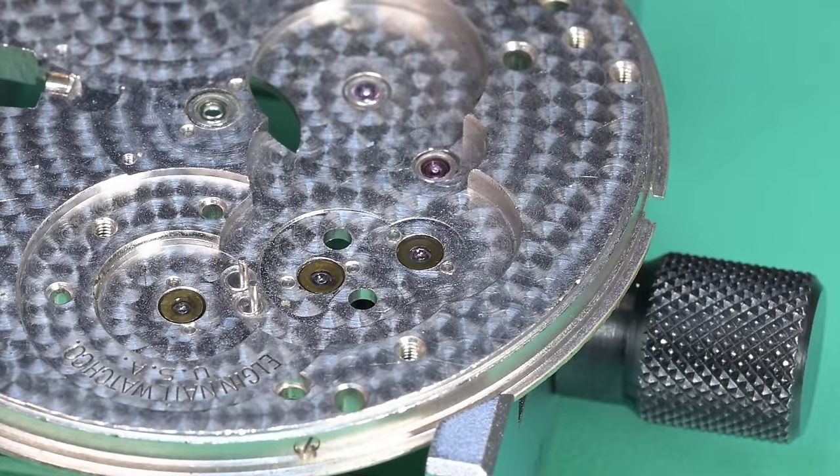I've got the spring on the opposite post temporarily so I can apply some grease to the mating faces of the yoke, to the post on the yoke, and to the contact face of the spring. Now we can put that spring into place just like that — I'll use a bit of Rodico to clean up the excess. This right here is the contact face where the setting lever post is going to contact on that left side of the spring. Applying a dab of grease there and we'll put the setting lever into place — hold it and rotate it around until that post finds its spot — boom, saw it kind of drop down there.